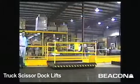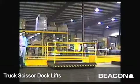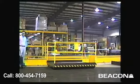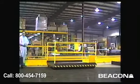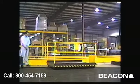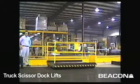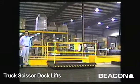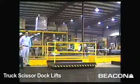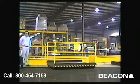The electric hydraulic scissor dock is manufactured in a variety of capacities, with a minimum of 5,000 pounds and up to a maximum capacity of 12,000 pounds. The smallest size available is 4 foot wide by 8 foot long, built up to the largest size of 8 foot wide by 12 foot long. It is either mounted in a pit with removable handrails, which are required by OSHA, or it can be mounted above ground, which requires an approach ramp to access it.